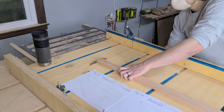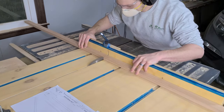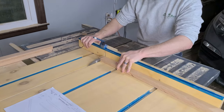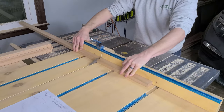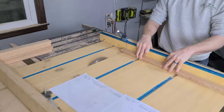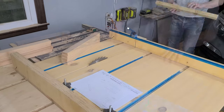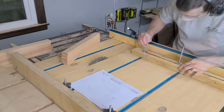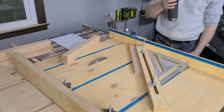We leave these a little long so that they have extra material for the miter corners. Since these cuts don't have to be precise, we quickly mark them out with our tape measure and then chop them up. Now that we have the individual pieces we need to miter the corners. We don't trust our miter saw to do this accurately so we're going to do it on the table saw. This block of wood has a slot routed into it to use as a guide with our crosscut sled.